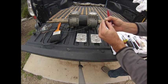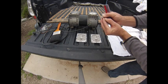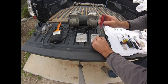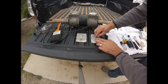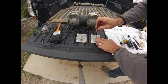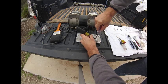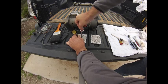Make sure that the retainer plate for these valves has the word 'up' on it, and that needs to be facing up. This also has a beveled edge on it that needs to be facing towards the flapper valve. Once you have those three pieces put together, you can go ahead and screw them down into the head plate. You want to get these as straight as possible. Use some sort of flat edge to keep them from spinning when you tighten them down to 18 inch-pounds, which is the specification. 18 inch-pounds is not very much — it's very easy to strip these head plates, so be careful.